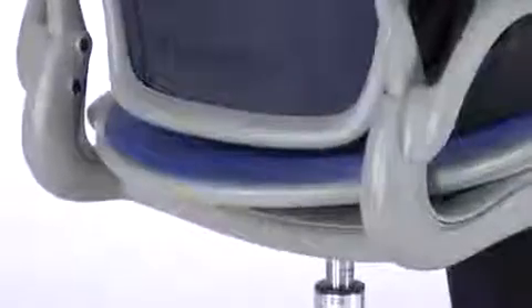It's the simplest task chair ever made. When the user reclines, the seat slides up a ramp on the support frame. It's just the act of sliding up that ramp that adjusts the tension for the user. In other words, the chair becomes a scale, and the information is transferred mechanically into the force required to push the back into a recline.